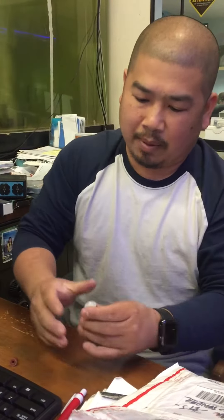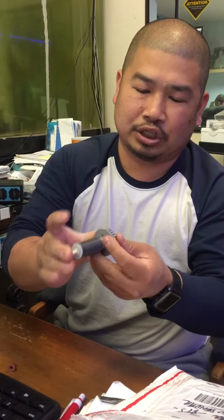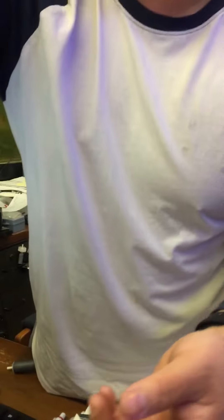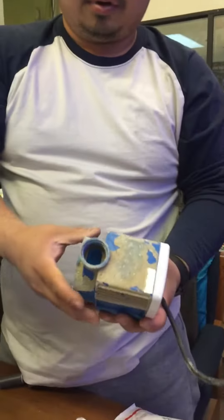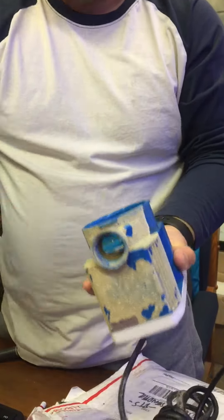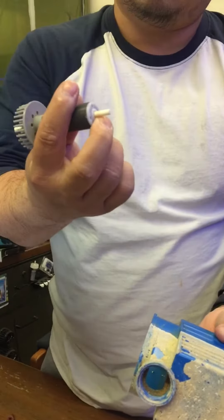So that's why the pump is not working. You need to take out the impellers and the shaft to clean the shaft. This is the pump that we got back from you. You see how much calcium deposit is around the pump? That calcium deposit is also inside here on the impellers.